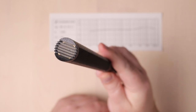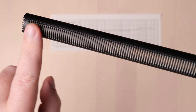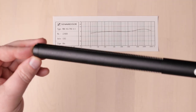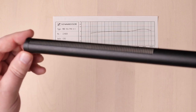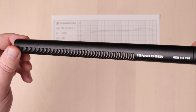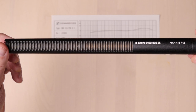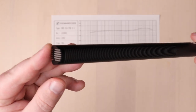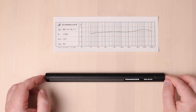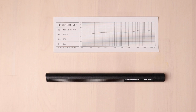The pointy end is the front of the mic, and the back is an XLR connection. The grills on the side are part of the interference tube, designed to reject sounds coming from the sides while allowing a tight beam to be picked up from the front. It runs on regular, plain old 48-volt phantom power — there are no batteries. It's well RF-shielded since the body is made of brass. The 416 is well known as a workhorse mic and is often the very first choice for challenging weather shoots — and even without weather, it's just a first choice, period.